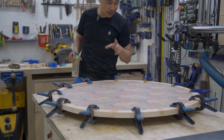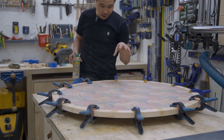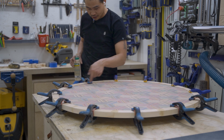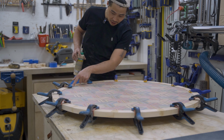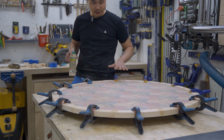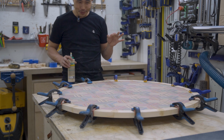Now, I think this is gonna hold up and I'm just gluing it onto the table. Then I'm gonna sand the top once more because I have a few scratch marks, clean this up, sand it, and then do an epoxy pour up to the line. I think it's about an eighth of an inch and that'll be a glassy top. Sand everything nice and flush, flip it over, sand it, and then buff it out and we should be good.